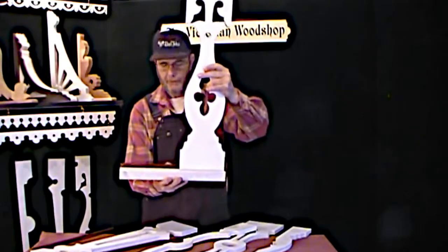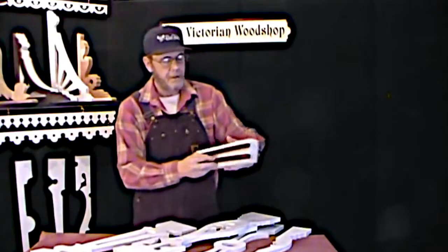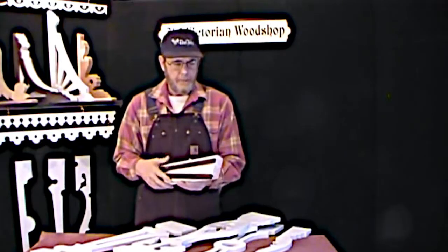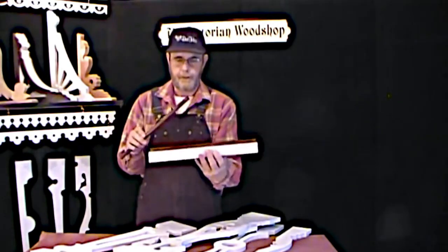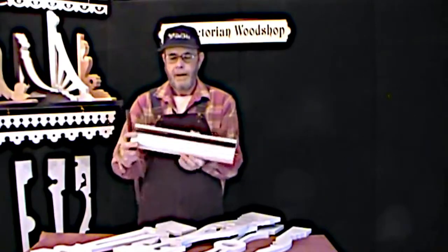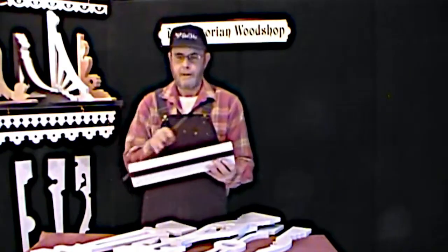It's a nice little way to do it because it also gives you a three-dimensional look. Then when you're done, take another strip of molding and put it on the board as well. So what you've done is made your own groove, but it's a nice three-dimensional groove — extremely easy to do. A lot of people will go with the flat end of a two-by-four or two-by-six going down, but remember if you have a long span, you'll want to put some kind of a block in the middle to keep the weight up. However, if you install them with the skinny end up, you won't have to worry about that, because that will take all the weight.